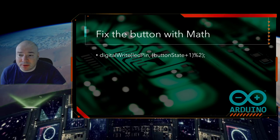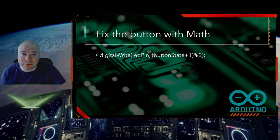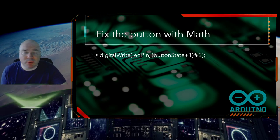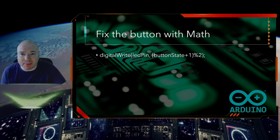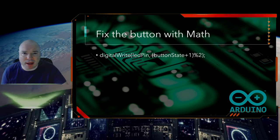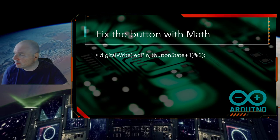If we had a button state of 0, 0 plus 1 is 1. 1 divided by 2, well, that doesn't go in at all. It just has a remainder of 1. So again, that flips the button state. We'll do a lot more modular math as we go through, but it's a really useful technique in computer science for manipulating numbers to make some logic controls that allow us to change things, to make some kind of mathematical decisions for us. So it's kind of cool. So if we go ahead and put that in our code, let me switch over.